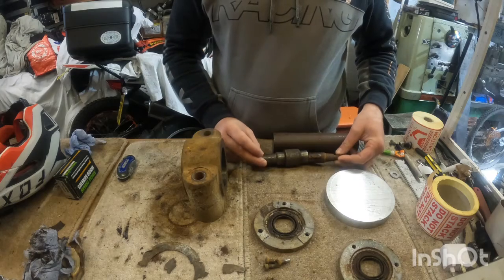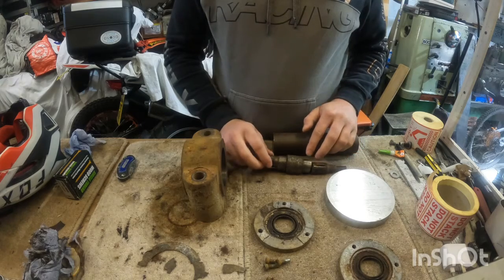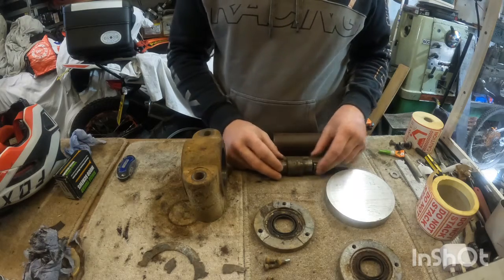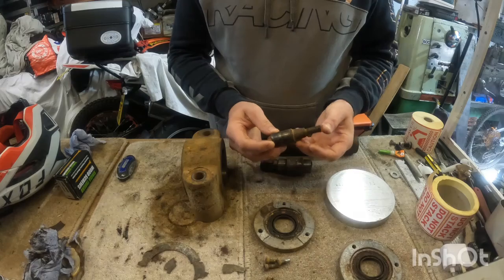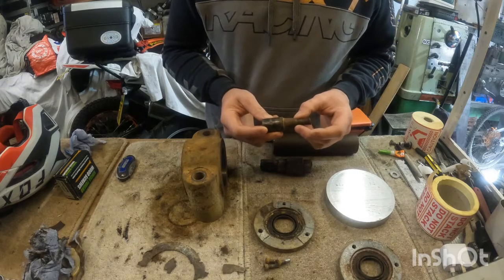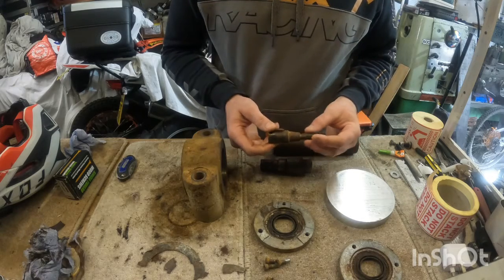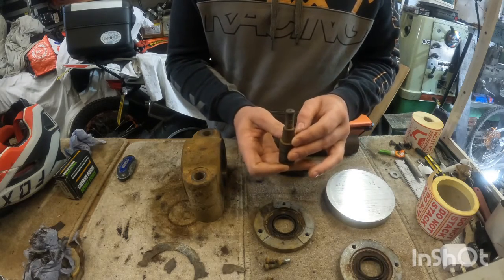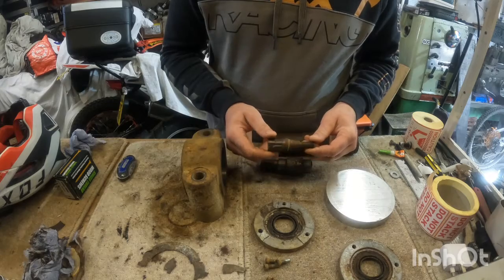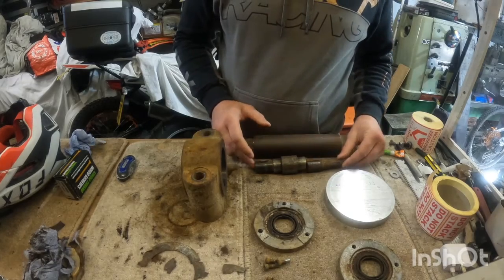to suit this gearbox with 8mm keyways either side, two bearing races, well, shoulders for the bearings to slide onto, and then a tapered fit for the drive pulley itself, and an M12 1.75 pitch thread on the end, as it's been mushroomed out when it's been hit to drive the shaft out of the gearbox. So shouldn't be too hard, this project. Nice little one. I've ordered in the parts now.